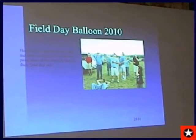Next slide. This is where every week they launch an ozone monitoring balloon, which looks like a beer cooler. Inside it has a pump that pumps the air through potassium iodide, and they measure the current to detect ozone. There's only four sites in the United States that do this, but they do monitor this worldwide, and I'll have to see if there are some in Europe. Pretty sure there are. The neat thing is, they have some excess lift. So if I can keep my payload experiment under 10 ounces, I get a free ride every Saturday. And I have flown 30 free rides in the past 3 years with them to test out different things.